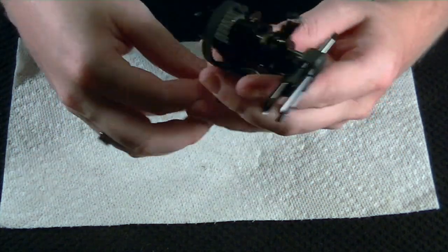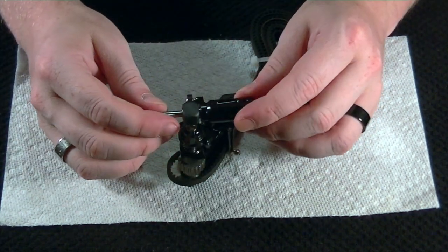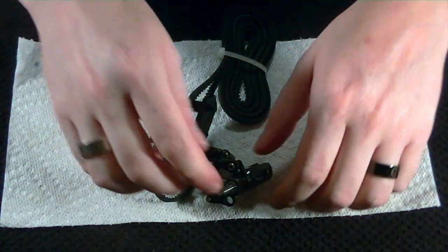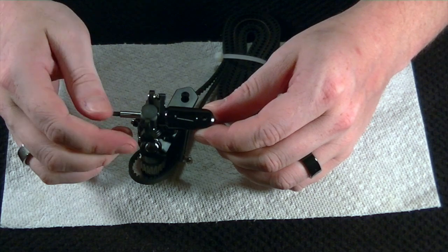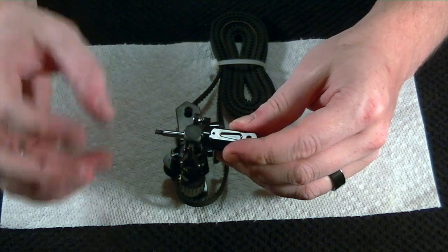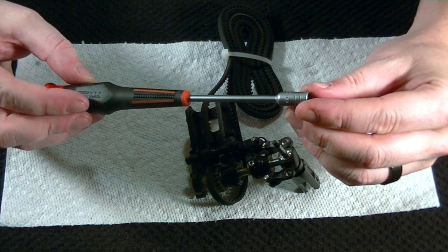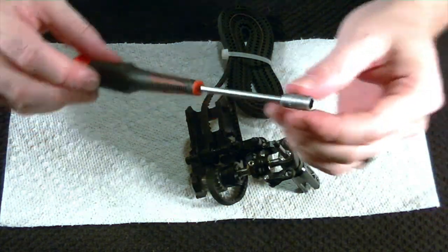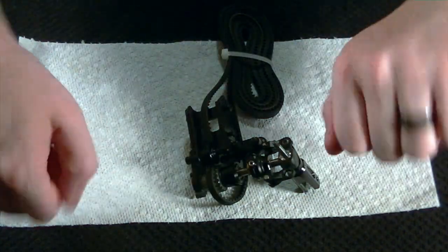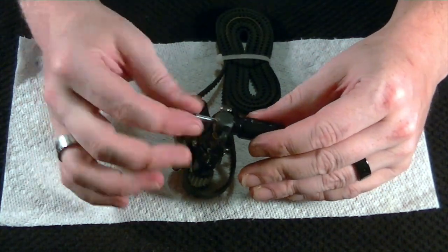But anyways, I wanted to give you a quick tip on the removal of the tail arms. Now, this design is a little bit different. On most machines, we can take our hex drivers and just counter torque them and lock it down. This one's a little bit different because it uses the nylon locking nuts. So you're going to need two 5.5 millimeter nut drivers, or whatever brand you have, you're going to need two because you're going to have to counter torque those to get them loose. But of course, as always, only one side comes loose, and as you can see, I got that off.